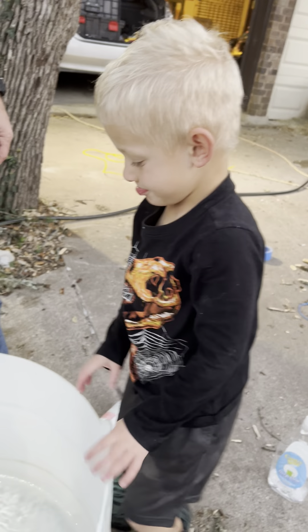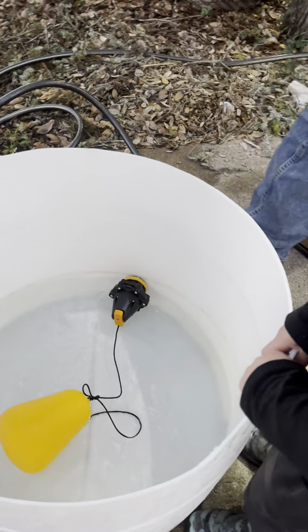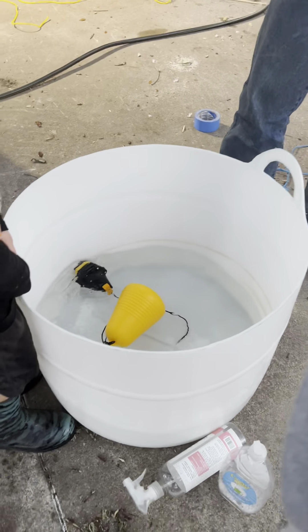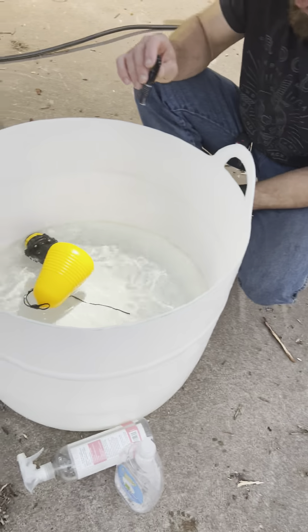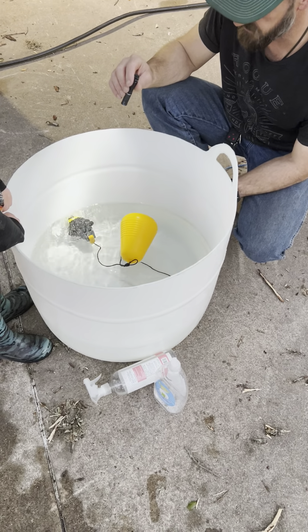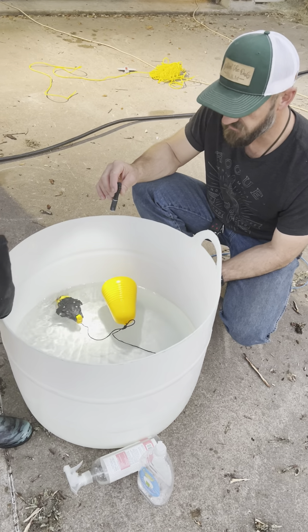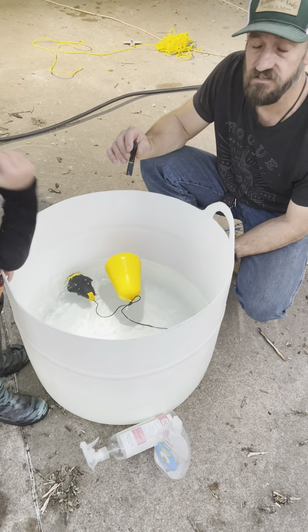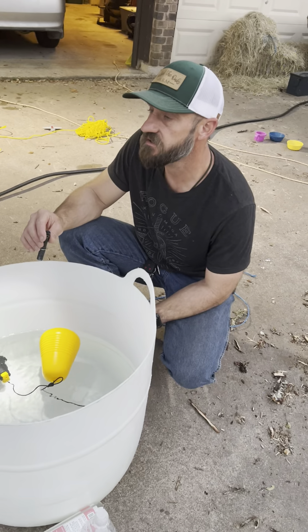We'll make sure this is running well. This is on level ground right here — we might need to pull it up a bit. Yeah, I put these handles on here to make it easier to dump and drag. I won't drag it more than about 100 feet at a time. It's filling up pretty fast — this is supposed to do up to 90 gallons per minute, especially if you have high water. We have a one-inch pipe going into three-quarter right at the end, so it'll be blasting out. This will easily keep up with seven calves.